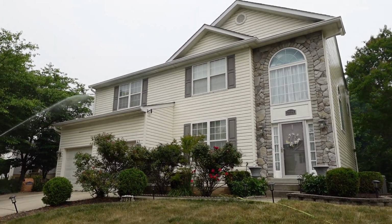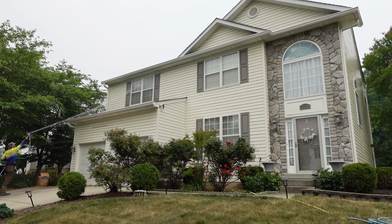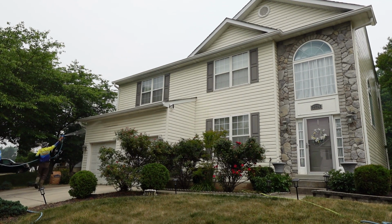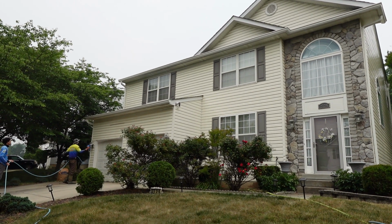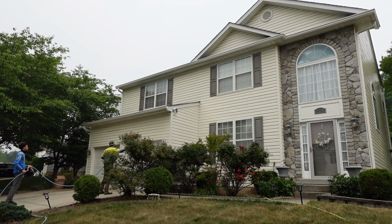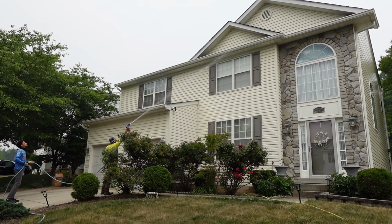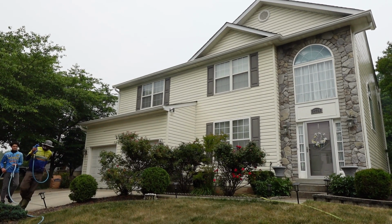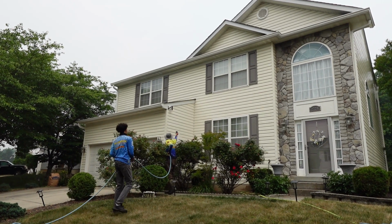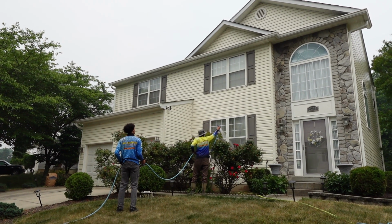And then you also got to think about pressure washing. You would have to get a ladder, and that's really unsafe, and your liability goes through the roof, and you can damage other things as well. You can damage the siding, break windows, etc. So that's why professionals prefer this method. Again, soft washing is actually what is recommended by the manufacturer, because you're essentially hitting this with less than 200 psi, which is about the equivalent of what's coming out of a water hose. With that small amount of pressure, you're not going to damage windows, you're not going to break screens or any of those things.